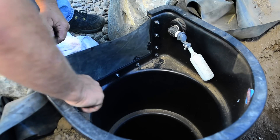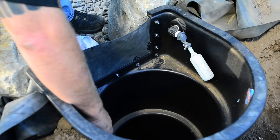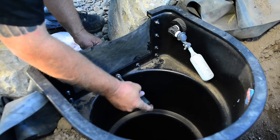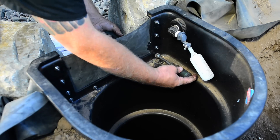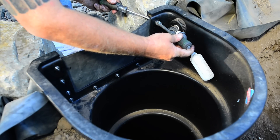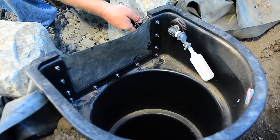I've gone around the entire faceplate one time and now I'm going to come through and give it a more serious tightening — that should be it. Last couple of tips: make sure you don't have any wrinkles, because if you see a wrinkle in there you're most likely going to have a leak. Also make sure you don't have any underlayment between the liner and the faceplate — it should be completely moved away. Once all bolts have a serious tightening, I'll come through with a razor blade and cut the opening.